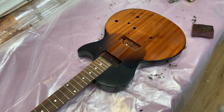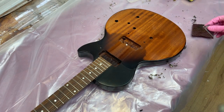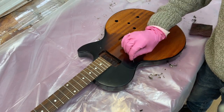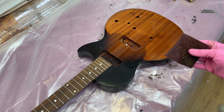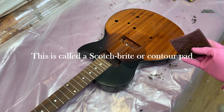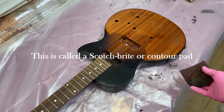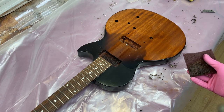I've been using a couple of other tools to help bring it off a bit quicker. I've been using a razor blade — a Stanley blade — as a scraper. You have to be careful not to dig in, because you don't want to damage the wood and end up having to sand out marks. I've also got this abrasive pad, which is a bit more aggressive than the pan scorer — it's more abrasive and has really speeded things up, though it does get clogged quickly.